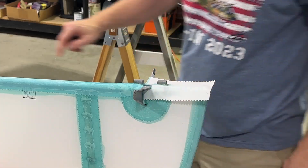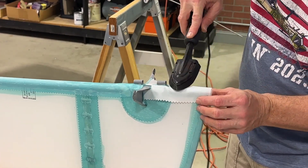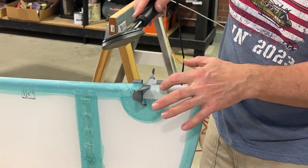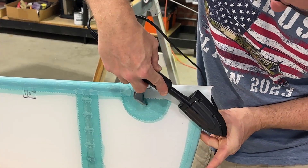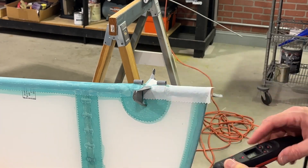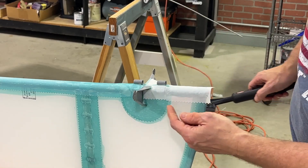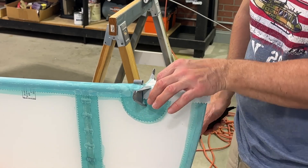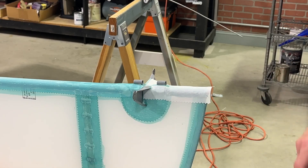Now what I want to do before I glue that — like I did on the other ones — I'm waiting for my iron to heat up, but we'll see what it can do right now. I want to iron this down so that when I glue it, it tends to stay in place. We got this big hinge thing here we're working with again. Just like the other ones, there's kind of a half moon there where that hinge is. So what I'm going to do is turn this up to 300 degrees and try to shrink this area back — it's short here because there's a big doubler where this hinge is, so it's basically going around a larger diameter tube. We'll just wait for this to heat up and I'll try to straighten that out.